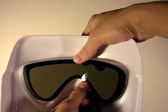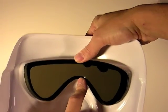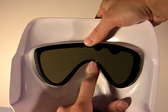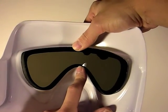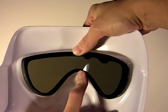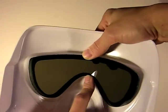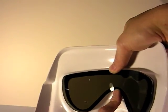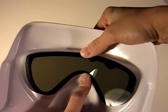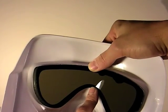Slowly apply that pressure into here, very gently pushing it into place, and making sure that the lip of the cutout exceeds the aperture of the faceplate. And you've got a nice even curvature in there, and if you just hold it for a few seconds, let it cool down nicely, then it will cool down and hold that shape.